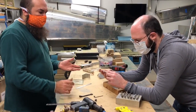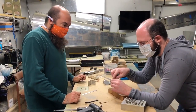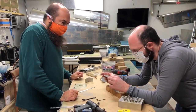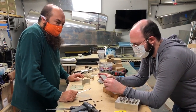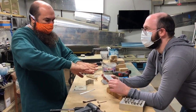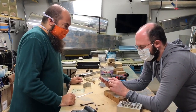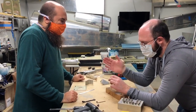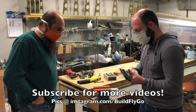That's always baffled me — how can it deform only within like a quarter of an inch? Well, you can go down the rabbit hole on the technology of dimple dies, but they've got a sort of reflex up-curve on the back end so that when the metal springs back, it springs back to exactly where you want it. Crazy, isn't it? Stay tuned for the next episode where we talk less about this and actually start squeezing some rivets.